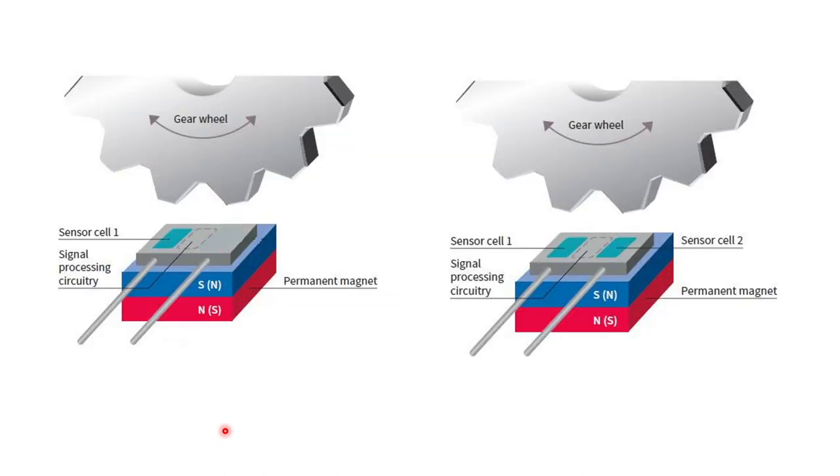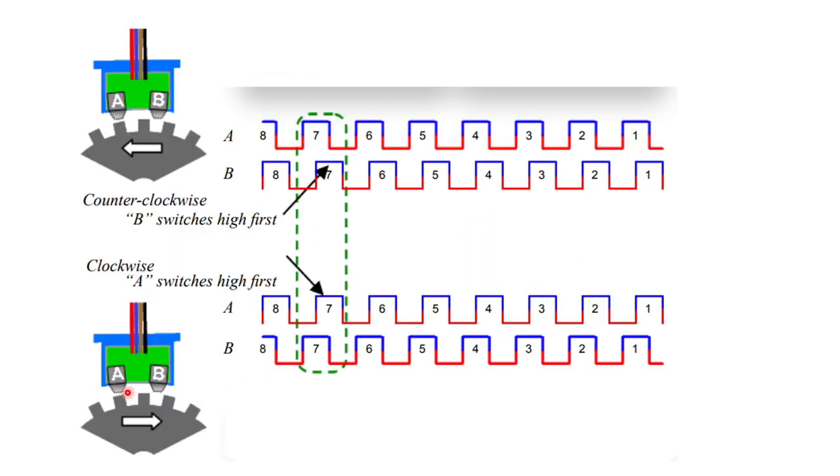In reality the two channels look something like this — you have one sensor and now you have two sensors. One thing to note: the spacing between the two sensors A and B must match the spacing between the gear teeth, because if B were to be slightly off — on the left or right on top of the teeth — the waveforms would not look correct and you would not be able to determine the direction. This means only a specific type of wheel can work with the two-channel setup.